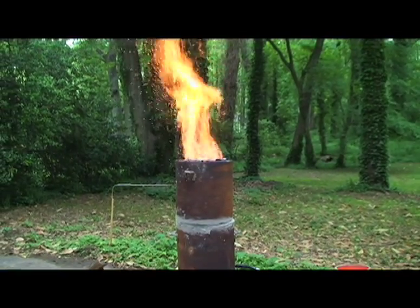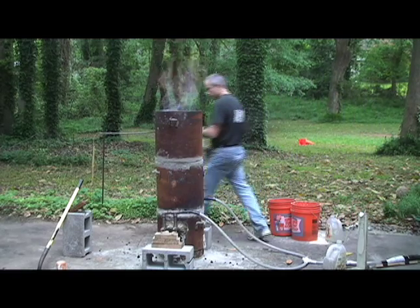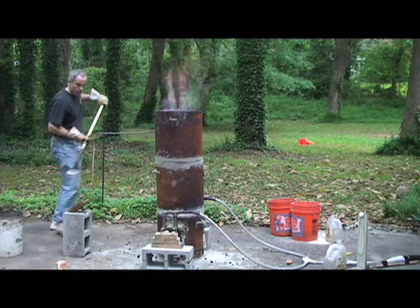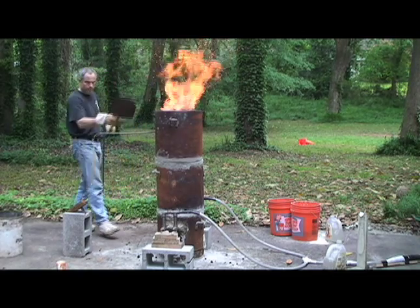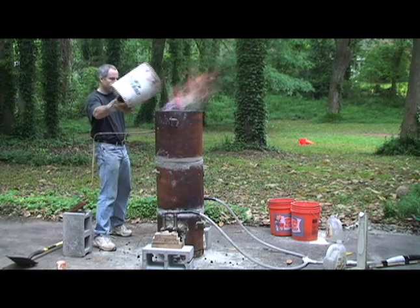As the iron descends through the furnace, it also takes on carbon. If the iron doesn't take on enough carbon, it will yield only wrought iron, which is useless to a bladesmith because it can't be hardened. On the other hand, if the steel takes on too much carbon, it will become what is known as cast iron, which is too brittle to be usable for steel.